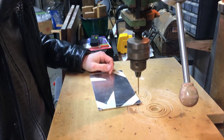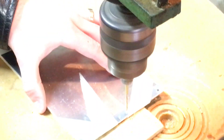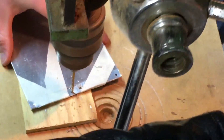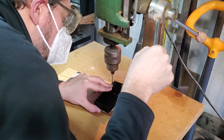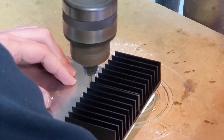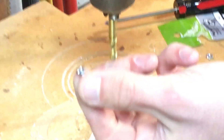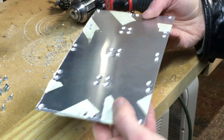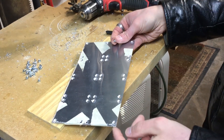That drill bit's bent. That's better — just kind of a sacrificial piece of wood. We're countersinking these holes now — basically just using a larger drill bit than we used before. That way we'll get this conical profile in the hole, but we don't want to go the whole way through the sheet. We've gotten our sheet cut and we just finished countersinking all these holes. The next step is just to clean up all these holes and file the edges.